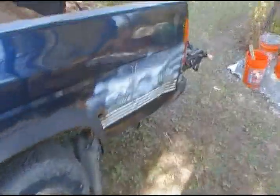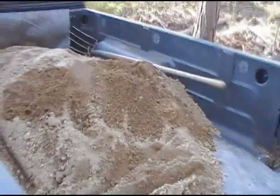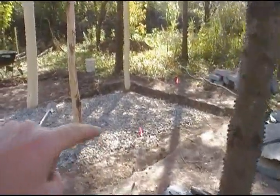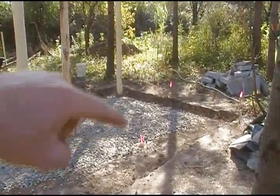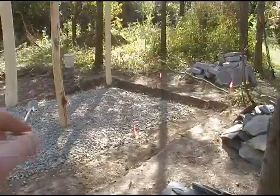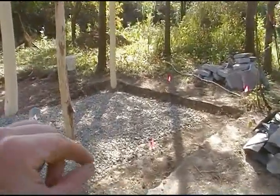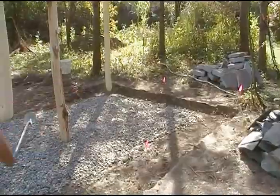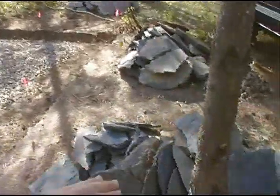And then on top of that, I've got this really fine sand from a greenhouse project I'm involved in — we're digging a pond there. So I'm taking this subsoil material and we'll put that fine sand on top of the drainage stone about an inch or two thick. That'll have PEX tubing embedded through it in a big spiral, which will eventually hook up to a wood stove water jacket so that'll always be heating the water. And hopefully, if I can figure out the physics of thermosiphoning, the hot water will create pressure and draw in cold water behind it. So there'll be a continuous loop of hot water in the sand with heavy stones sitting right on top, giving radiant floor heating.